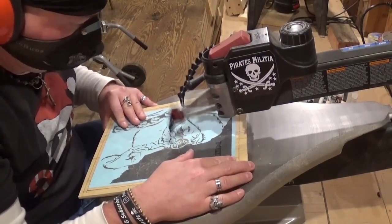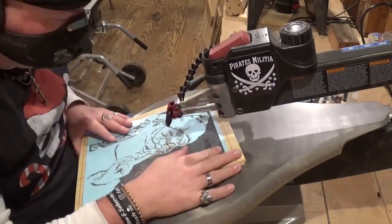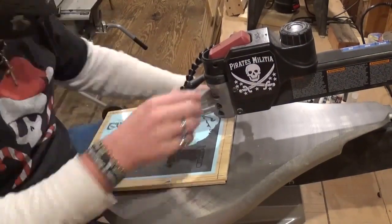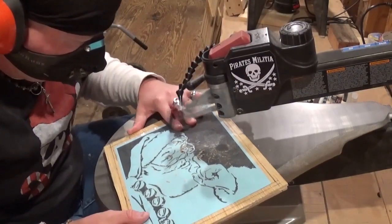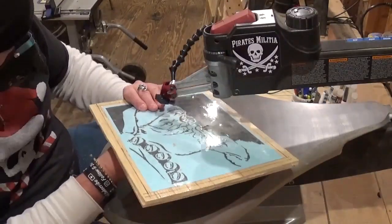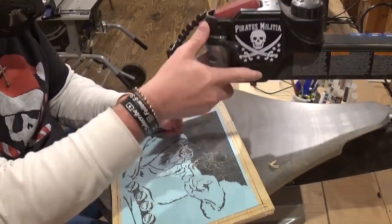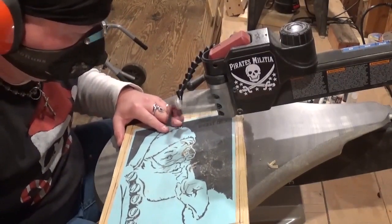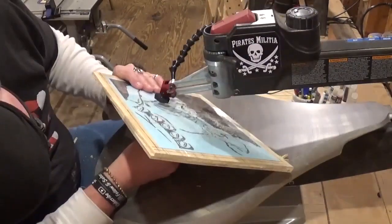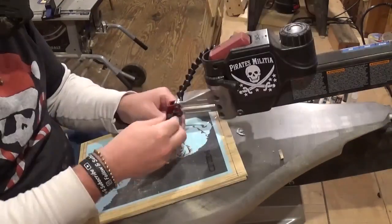That's why I'm beginning with the eyes — that's just my opinion. I am no spiral scroll saw blade expert, but I did experiment with cutting in different styles. I tried pushing into the wood as is normal with scroll sawing, pulling the material towards me, and pushing it away. I felt I had the best control feeding it into the blade — pushing it in but also pulling the material back towards me cutting. It's definitely a learning curve; I had done some spiral blade projects last year, shied away from them, but now I'm picking them back up and will use them from time to time.